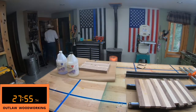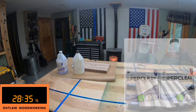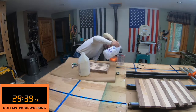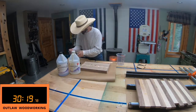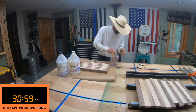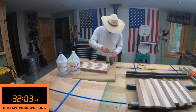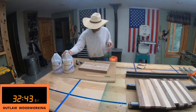I pour the epoxy — right here I'm using Super Clear and I've got some leftover dyes, some greens and reds, that I'm going to mix up. In the future I think I'm going to carve like six of these at a time because I tend to mix too much epoxy. It's hard to judge how much void you have in the V-carve. Right there I mix it up for about five minutes — the room temperature is 70 degrees, which is ideal for this epoxy — then I pour it.